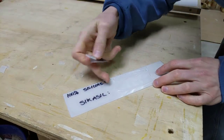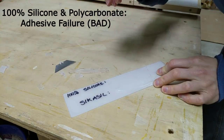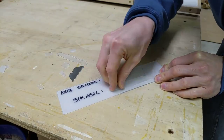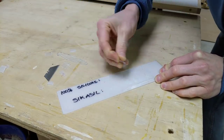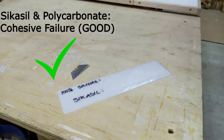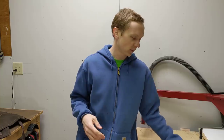Now let's try both on the polycarbonate. Starting with the regular silicone — that is an adhesive failure, and that is a total fail. Now the moment of truth for the CicaSeal on polycarbonate. Looks like it's sticking pretty good — it's got a really good grip on it. I can't get it to come off the polycarbonate. That's a pass. The results are pretty obvious: if you need to glue polycarbonate, like on this dust collector, avoid 100% silicone and get yourself some CicaSeal.